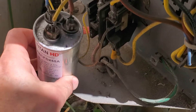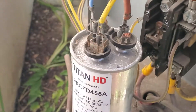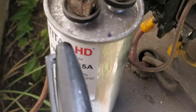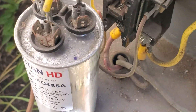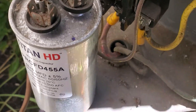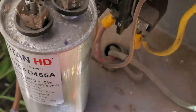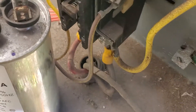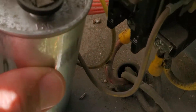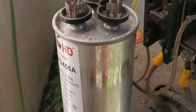If you have never done it before, before you remove those cables make sure you pay attention to what's written on top. Sometimes there's a bunch of rust so you need to use a little sandpaper to get it out. Right here there's a letter C, which means this is COMP. I'm going to write C. And this is FAN on this one — you can actually see it, so this is going to be FAN.